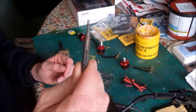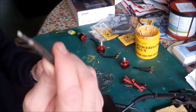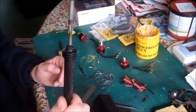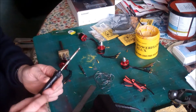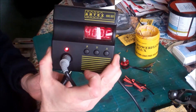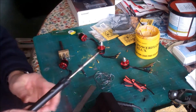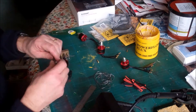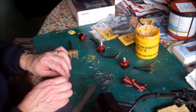The bigger the tip the more heat reserve you've got. This tip here is about 3mm across. I've just taken that one off and put this one which is a good 5mm. Yes it's a dirty tip, I'll be coming to that in a minute. I've just turned this on, running it at 400 degrees centigrade. That's probably quite hot for this tip because I've been using the smaller tip for some soldering recently.